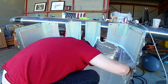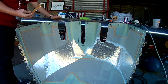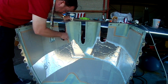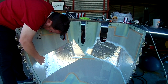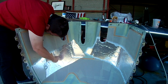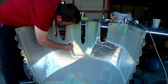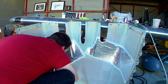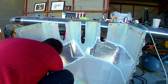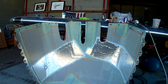The nice part is that we can put that in and then epoxy that in. The idea behind the epoxy is just to seal the sides in so that if any oil tries to get in, because if any oil gets in there, it could deteriorate the adhesion of the thermal material, and you don't want that. So this basically just is protecting it. Also, I'm going around the edges of where the cutouts for the exhausts actually are, because we cut through some honeycomb material, and you're like, well, I don't want oil to get in that either. So we're just sealing up those edges.